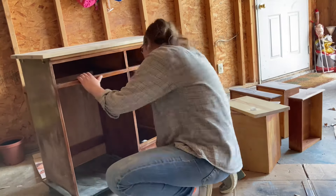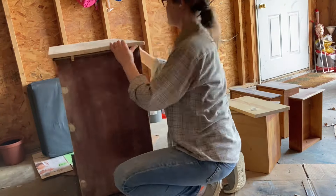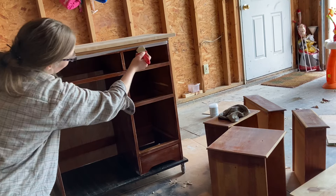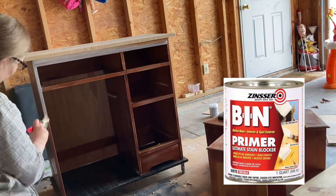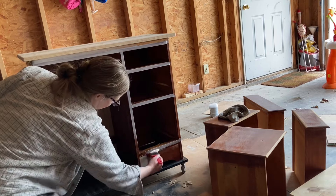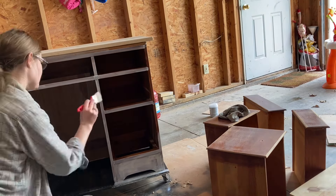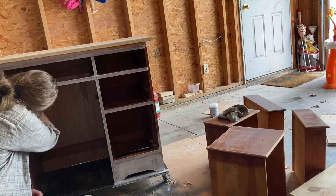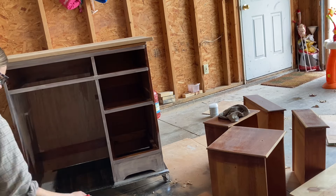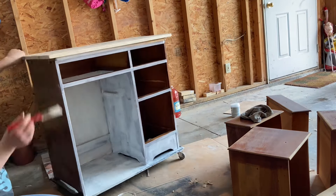After everything was finally sanded, I did a quick wipe-down to clean up all the dust so we could get ready for the priming. Here I am using the BIN shellac primer. I prefer the original, but I think this was the advanced synthetic variety, which I don't care for as much. BIN shellac primer is definitely the best for this project — I knew it was all wood and that sometimes the color can seep through, and I wanted to make it white. Priming is an extra step but it's definitely worth it, especially if you think you'll have tannins coming through on your paint.